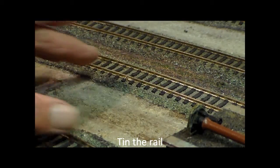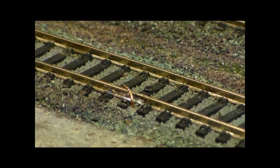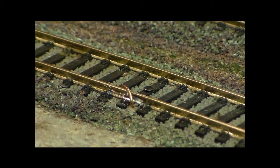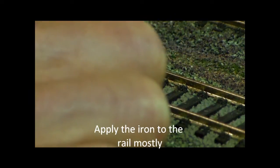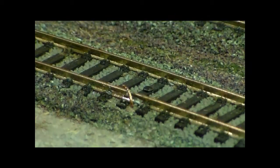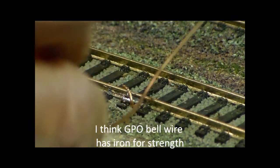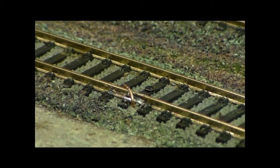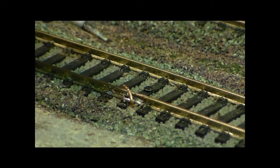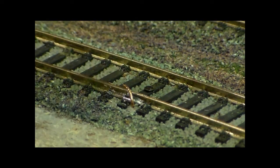The rail is now tinned and the wire has been bent. The wire in the bellwire seems to be much harder than the wire in the lighting cable or even normal mains cable — I'm not sure why that is. So it's just a matter of getting the two in close mechanical contact and then applying some solder.